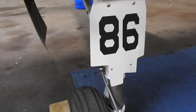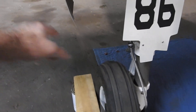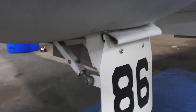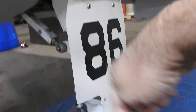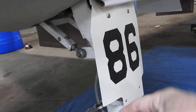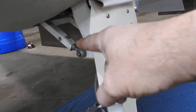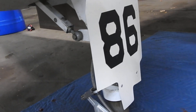Then I realized something. This landing gear — when it folds back, everybody knows the wheel rotates toes-out as it goes. These are adjustable rod ends. By adjusting those rod ends longer, it pushes the strut forward, which causes toe-in. Shorten the rod ends and it pulls the wheel to toe-out. So all I had to do was jack the plane up, take that bolt out, and screw those in a certain number of turns to pull that one degree of toe-in. That's what I did — four hours last Saturday and another four hours yesterday.